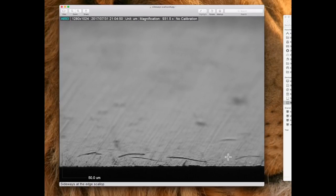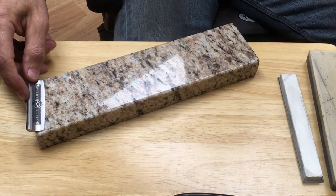Now we can see again these sideways marks — not a problem in themselves. But if you look closer down at the edge, you can see how it's kind of scalloped looking here, and even more scalloped over here. I think what happened was whatever made these gouges up here happened to be sticking up and banged the edge, and that's what gouged some of that out. That part is not going to shave as well as the straighter part, because when you strop it, it's not totally coming to the edge — it's not going to be as keen, not as pointy, because it's further up on the bevel.